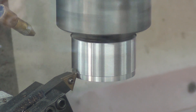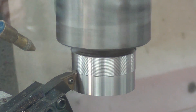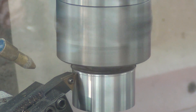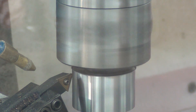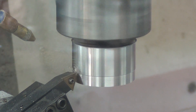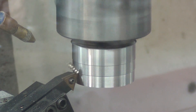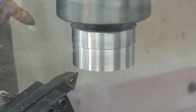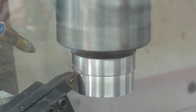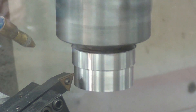This is 800 RPM at 0.006 per rev. Back to 11 thou per rev here. I'd have to check the code - I think these are maybe 20 thou cuts, maybe 25 thou off the diameter. I haven't even gone in and looked really - I guess I should. Maybe I'll check it and put it up on the screen.